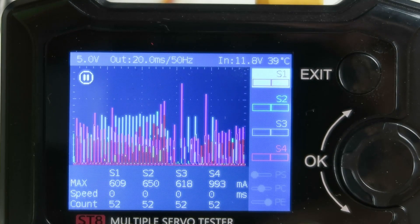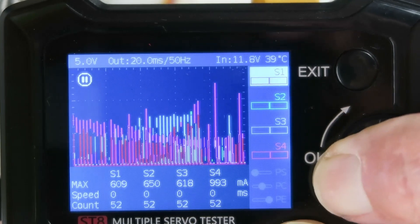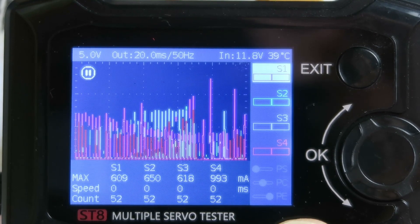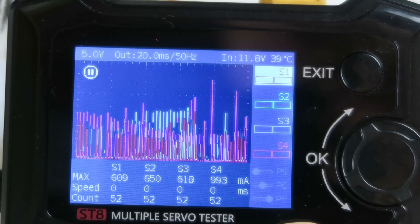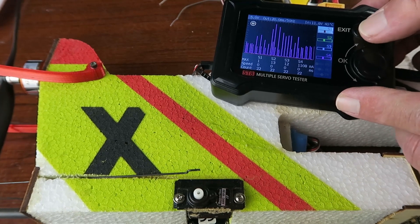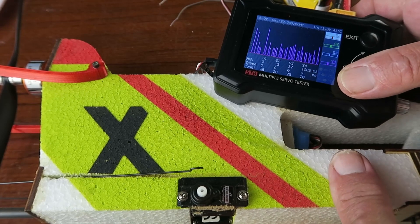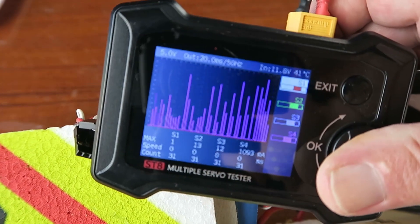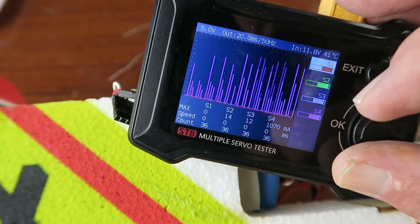If we stop there, we can actually move back through the display and look at those peaks. There is a peak there. Unfortunately the numbers don't change at that point, but we can get an indication that there may be something binding on servo 4. That needs to be investigated. First thing I've done is to disconnect the servo completely so it's just standing alone. If we activate it now, we can hear that there's a very strange sound that was being masked by the other servos before. Looking at the graph, we can see that even without any load on it, it is still drawing over an amp. Clearly, that servo is faulty.